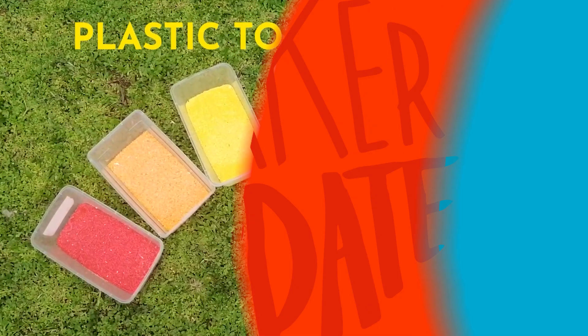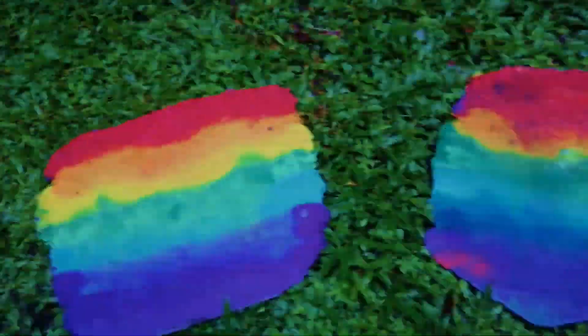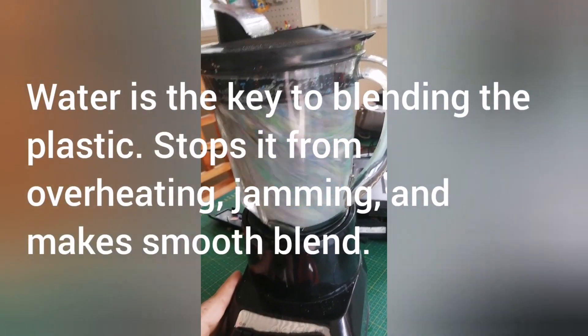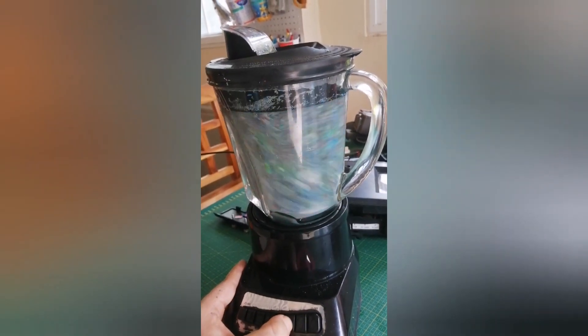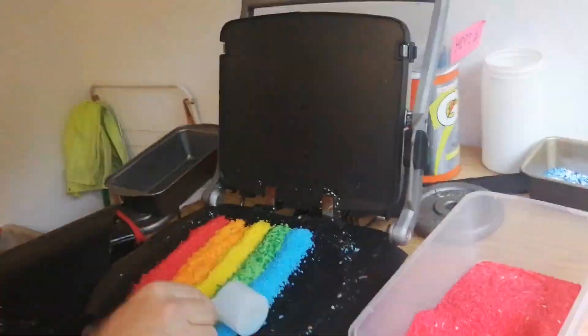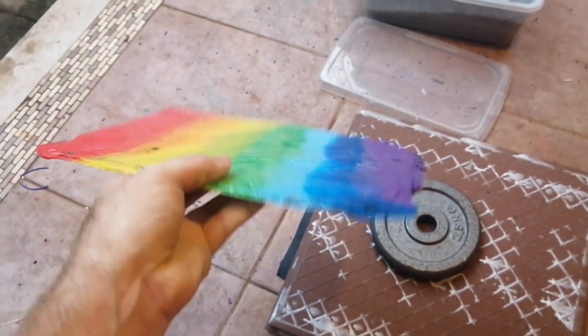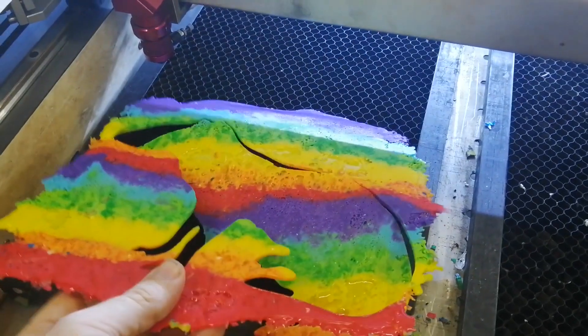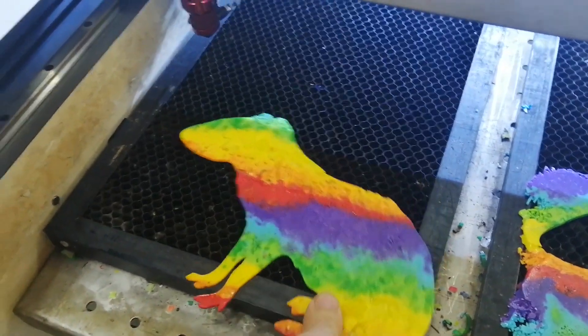Time for some tips and tools. Also on Instructables, I found this guide for creatively reusing your failed 3D prints. He begins by showing you how to shred your plastic parts using a household blender — the key is to add a liquid, either water or alcohol, to the mix, which helps the blender do its job and prevents overheating. He then uses a panini press to flatten the plastic particles into flat sheets, which can then be cut on a laser cutter or machined on a CNC router into various designs. It's a cool process with a colorful outcome.